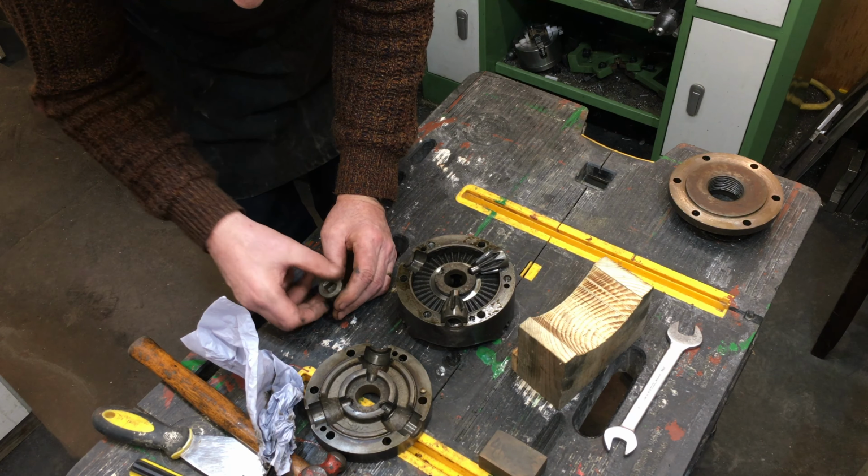I inserted the scroll plate back into the main body after a light spray of lubricant on the scroll face. The radial geared side was treated to more of a squirt than a dollop of lithium-based grease. This shim was measured for wear and tear. The shiny and obviously well-worn outer edge was 2 thou thinner than the inner unused section. So I cut a 2 thou shim to fit under the original one because I hadn't got any shim stock to directly replace it.